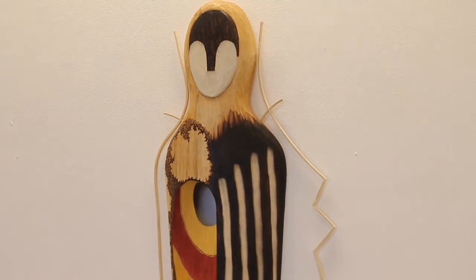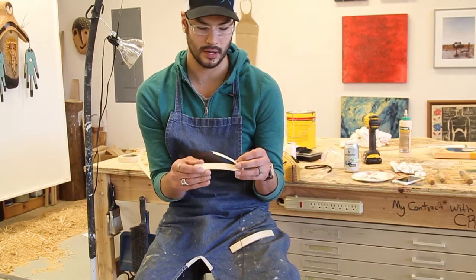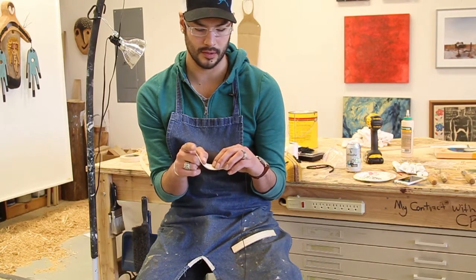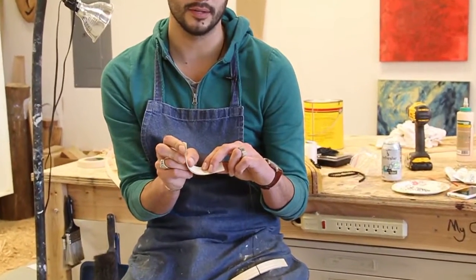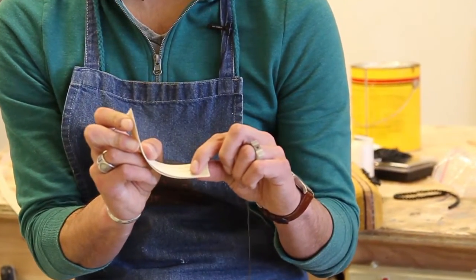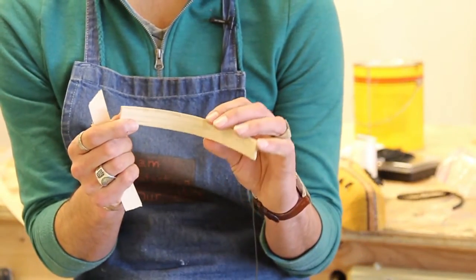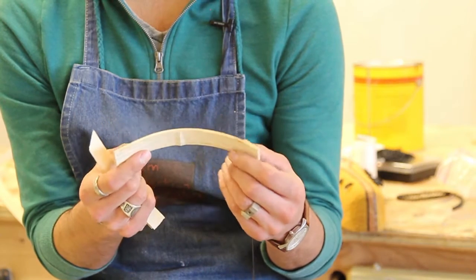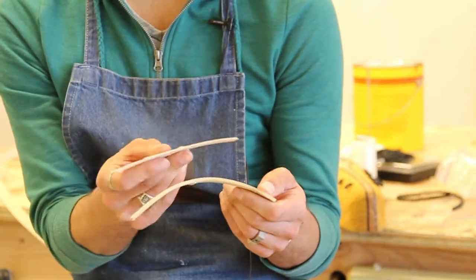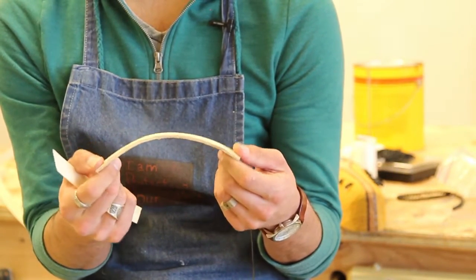And I've always been fascinated with the lamination process. You can basically bend wood into any form, or any material into any form, and glue it together, and it will stay in that position because the pieces will hold each other in shape with the glue. So what I was able to do is shortcut the process of steam bending. I took these pieces of veneer and laminated them together, and I put them around forms so you can create any shape you want.